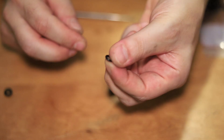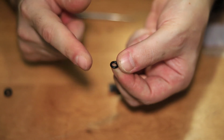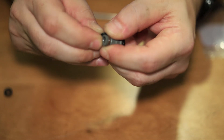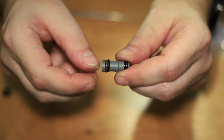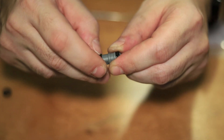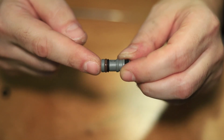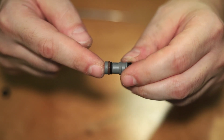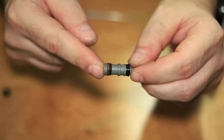I'll also leave a link in the description for this O-ring — it's 2mm thick, 9mm outer diameter, 5mm inner diameter. Once it's on there, push it into place so it's not as big as the brown O-ring. You can see it fits in there nicely — it's a little smaller than the bigger O-ring so it doesn't touch the walls, but it helps support the bigger O-ring in position. That's what it should look like when it's ready to put back in.